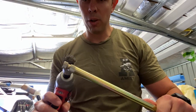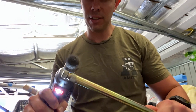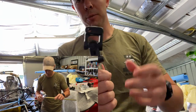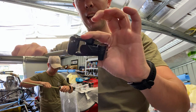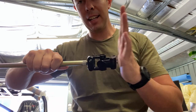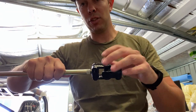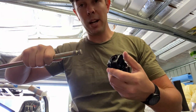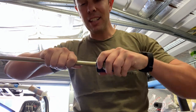Here's one of the steering shafts — you need to remove the anodizing off the end of it. I've just got a brass brush in a drill and I'm running it to clean up the ends. The instructions say to work the shaft in and out of the UJ just to get it to fit neatly. To start with I just didn't think it was going to go in. You can't hit this with a hammer because the bushing in here is either plastic or nylon and it would destroy that, so you have to be very careful. I've done this for about 20 minutes on each joint — it does eventually get there.